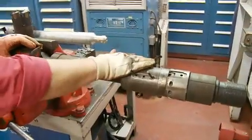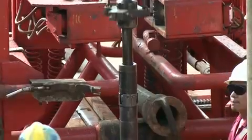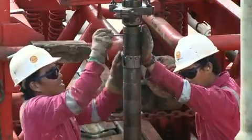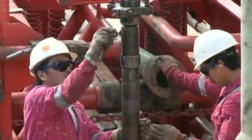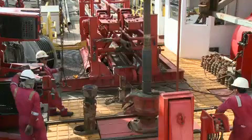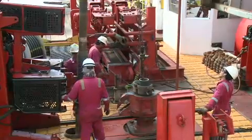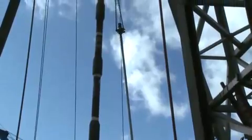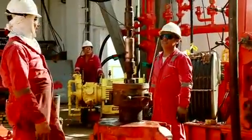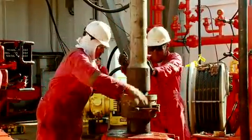These assemblies are the inner shear pin and outer shear pin assemblies — a sliding sleeve mechanism with two shear pins. When this assembly slides up, the outer shear pin slides into place, locked by two shear pins and the inner shear pin. When it goes in, the drill string is pressurized from the surface, the pins shear off, and the core barrel assembly strokes out nine and a half meters past the bit, retrieving the core. Once stroked out, we retrieve the core barrel assembly to the rig floor, take the coring assembly off, remove the barrel from the pipe, remove the liner, and reload it — re-engaging the shear pins to keep the barrel intact while traveling down the drill string prior to being fired.